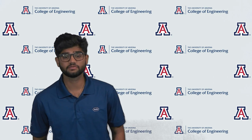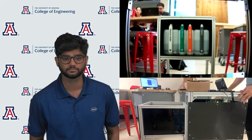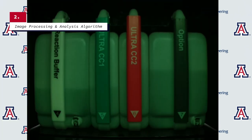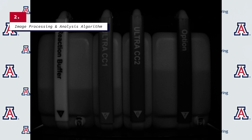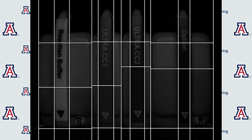The software system comprises two crucial parts: the fluid analysis software and the GUI. The software governs the entire process, starting from device login and ending with the display of fluid-level data. The fluid analysis software is divided into three major components. The first component is responsible for capturing the image: the lights are turned on, the image is taken and saved, and then the lights are turned off to conserve power. The second component is the image processing and analysis algorithm. Gamma correction is applied to the captured image, which is then converted to grayscale. The image is analyzed to detect bottle boundaries, and each bottle is treated as a separate entity to ensure accurate fluid detection. Fluid level detection is done by pixel intensity comparisons starting from the bottom of the bottle. Once the change in pixel intensity exceeds a preset threshold, the software detects the fluid level and saves it.